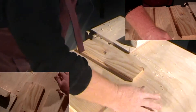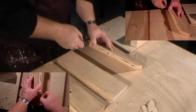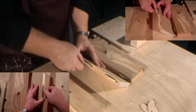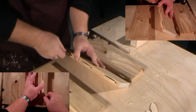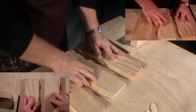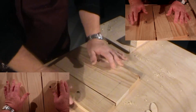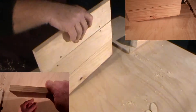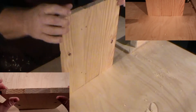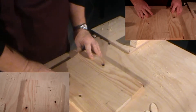I'll just line it back up again — this is where the arrows are handy — just being sure that the boards are in the same configuration. These are my biscuits; I'll just drop them into the slots. Normally we'd be filling these slots with glue and putting glue on the shoulders of the boards as well, but for the purposes of this demonstration we'll just leave them without glue. There they are lined up — three biscuits. Now we'll just bring those bits of wood together, lining up again. Our lines should all be continuous. We'll give them a tap to bring the joints together, and then another tap on the ends to align the boards.